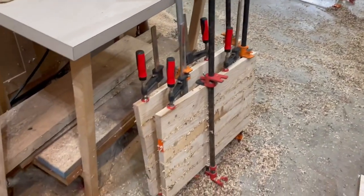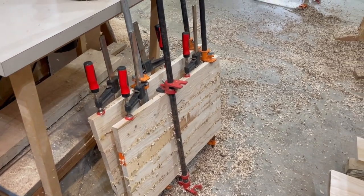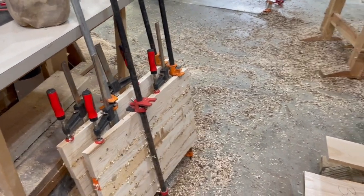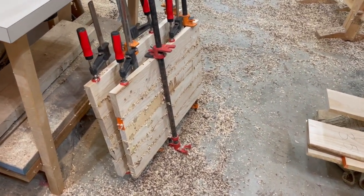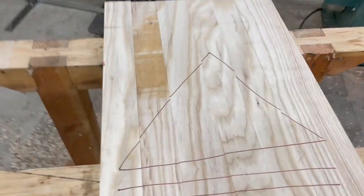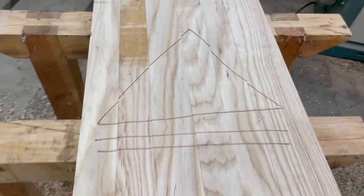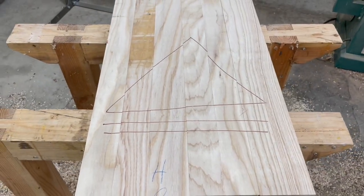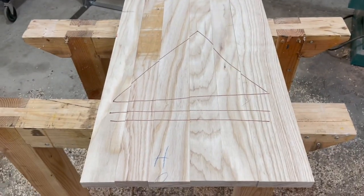Right now we are making panels for the doors on the sides. Two doors open, and two of them are just fixed to the cabinet to create a consistent appearance. So we've got two of them glued up. I'm not doing it a particularly fancy way. I've jointed all these together. This is how I lay them out. I learned this back at Greg Honest Furniture. I don't think there's anything particularly wild and crazy about it, but it works well.